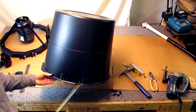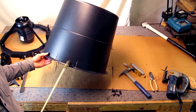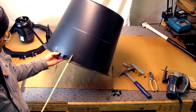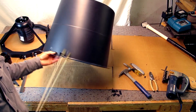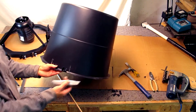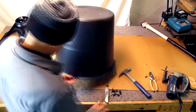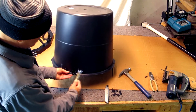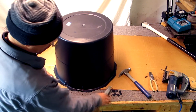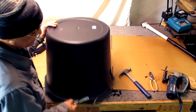These artifacts here are left from where the handle was — they're reinforced areas for the handle of this bucket. The best way to remove them: take a utility knife and score it from the backside. Then use a hammer and a nice chisel and chisel it out by scoring it first so that it doesn't tear out your lip. Score it with a utility knife on both sides if you can, and work it with a chisel — that's how you remove that.